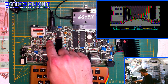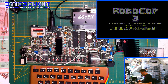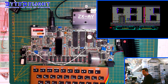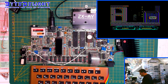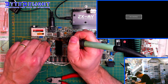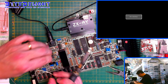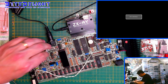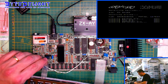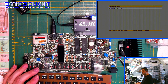When the TA2000 chip has been used, they forgot two parts: this inductor and this small capacitor. I'm going to add those, and when you add them, you get rid of the blue and yellow ghosting next to each pixel — it will improve the video output quite a bit. There will be one attached to this pin here, and the other one goes to pin 8. Let's try it this way. That should be it — can we see it already? It looks already better. Yeah, it's a lot better. There's no more yellow and blue ghosting next to all the pixels.